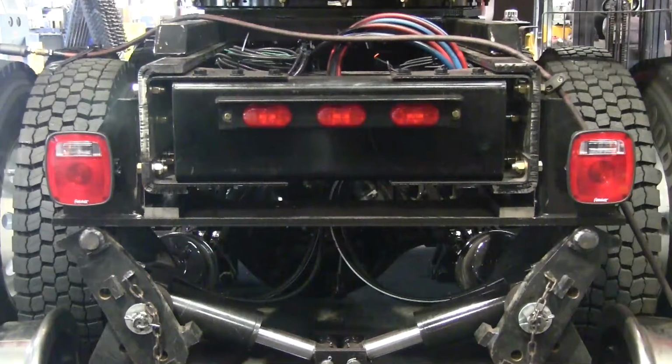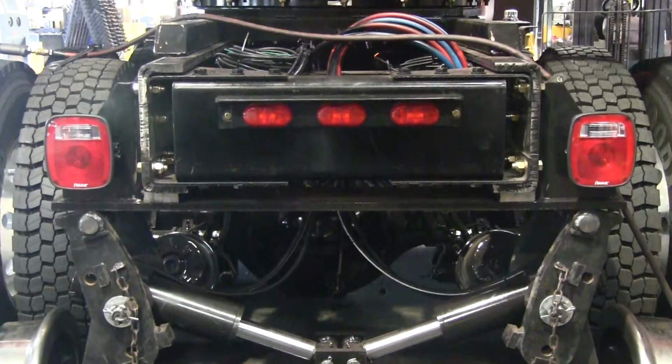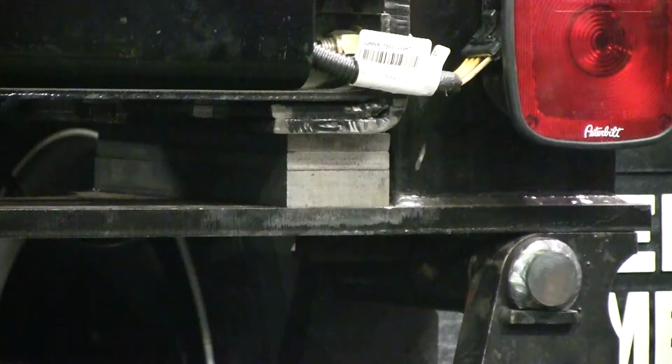The weight distribution between the rear rail gear and rear truck tires must be adjusted to ensure adequate braking effort can be applied. Improper weight settings could also cause excessive tire wear or improper loading of the rail gear axle. The rail wheel load can be adjusted by adding or removing spacers between the rail gear and the truck frame. Only use solid steel spacers. Never use hollow tubing in this location.